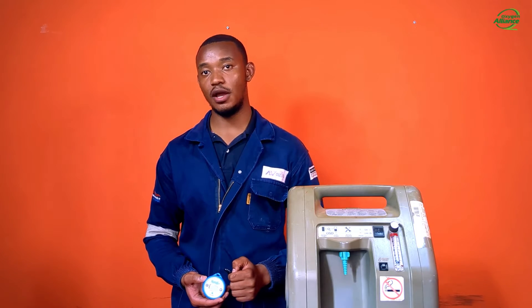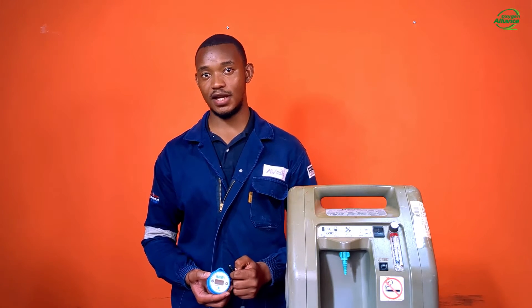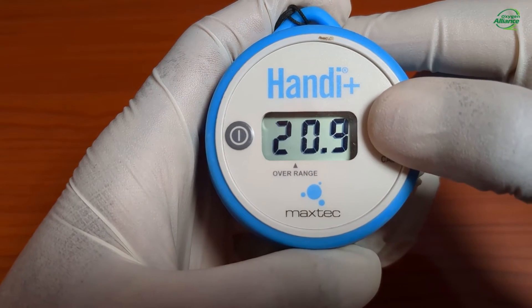When left untouched, the unit automatically enters sleep mode after 2 minutes. The LCD displays oxygen concentration ranging from 0 to 99.9%. In some instances it may go beyond 99.9%, displayed as 0.0.0% for 100%, 0.0.1% for 101%, 0.0.2% for 102%, and so on. If the display reads above 0.0.3%, the HandyPlus analyzer should be recalibrated. The calibration button is used to calibrate the unit. It is recommended to calibrate the HandyPlus analyzer on a weekly basis; however, more frequent calibration does not adversely affect performance.